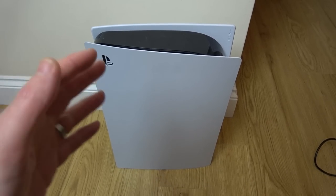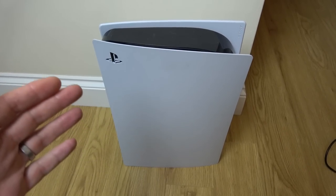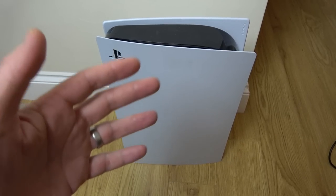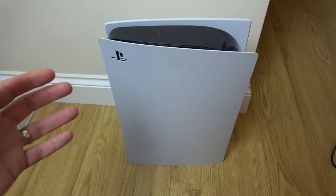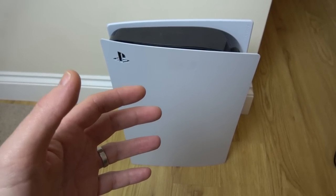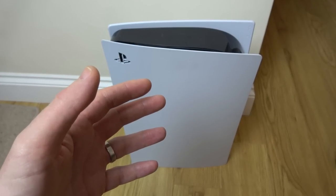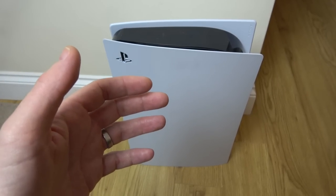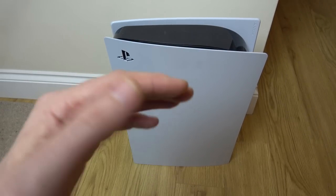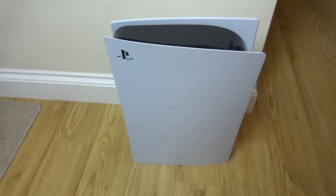The thing that's slightly annoying me is the initial cause, and maybe you could help me out in the comments down below. Was it the USB ports that shorted? Because the repair shop's not going to rip those USB ports out. I presume that was the original owner. Was it the USB port shorting that went into the APU that caused this to fail? And then somehow, because of that, it shorted those capacitors and blew up the MOSFET? Or was it the shorted capacitors that blew up, shorted out the MOSFET, and then put 12 volts into whatever that rail was feeding, whatever the MOSFET was feeding? I presume the APU, but I could be wrong.